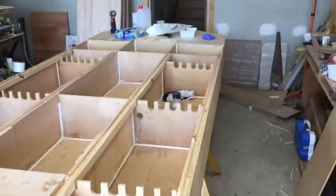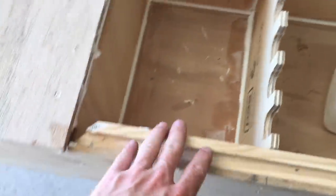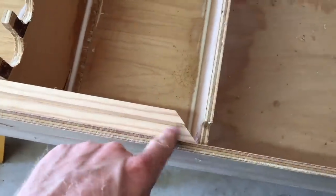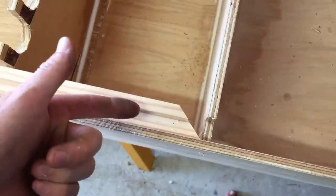Front and rear deck is now on. We're gonna continue to build the rails. So we're just about to run these through the saw. We've done four of them already, but we've got to do it on this one, and these three. We've got to cut all of them up. We run a 45 degree angle. We cut 20 mil across and then 10 mil down. And then we'll just join them all together.